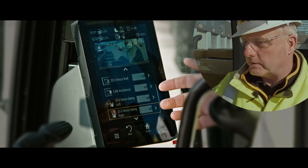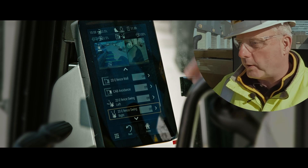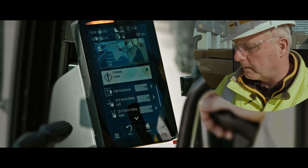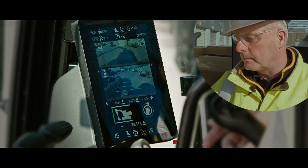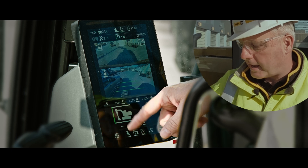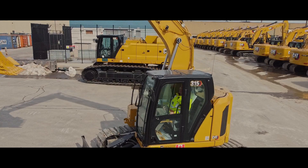To turn on the eFence wall, we're going to stick out to where our point is — where we don't want to go any further — and we're going to activate it by pressing here and it will turn green. It's now active. So we're going to pull our stick in. Now you can see here on the screen, we have a wall that is activated. So when we stick out, the bucket will automatically stop.